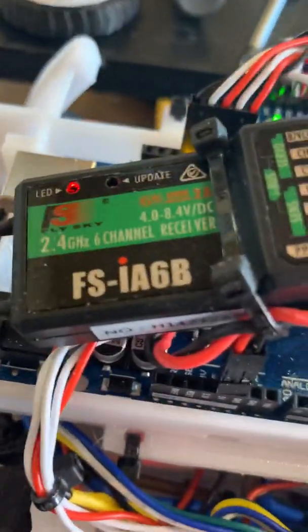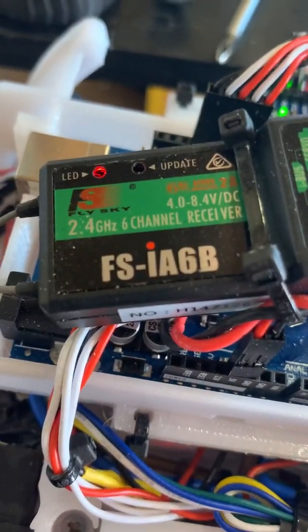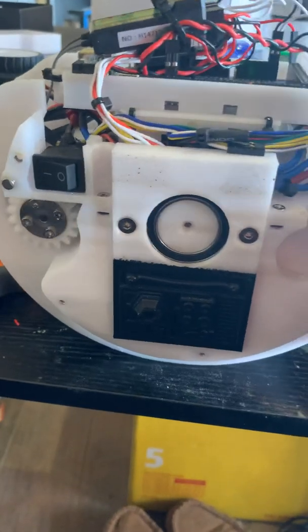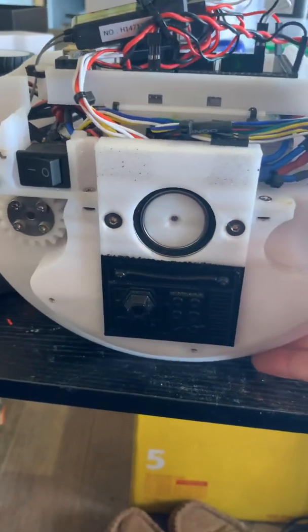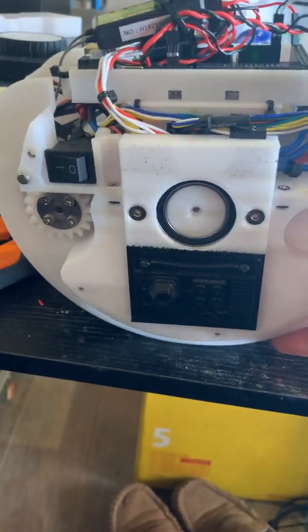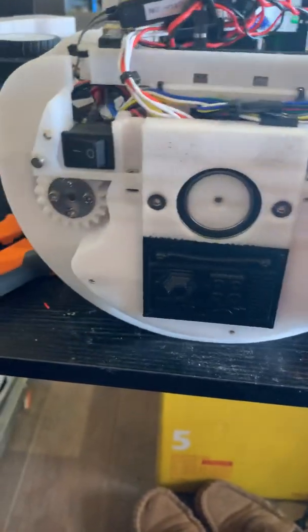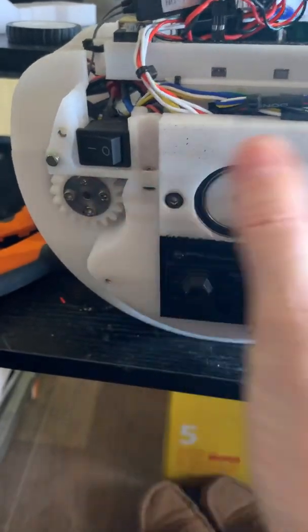You can see on there I've now got a little LED light showing a solid signal and everything's powered. So the first thing to check is: keep it in the frame, don't put the wheels on at this stage, and just tilt it back and forth — you should see the wheels starting to move, which means you've got yourself balancing.